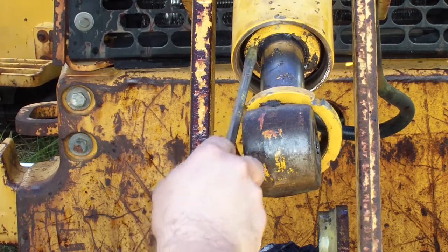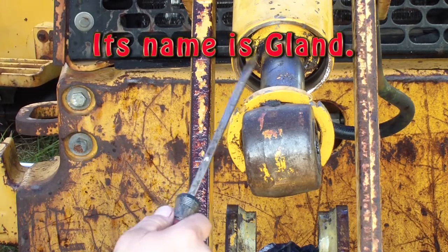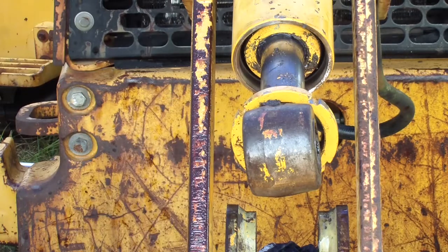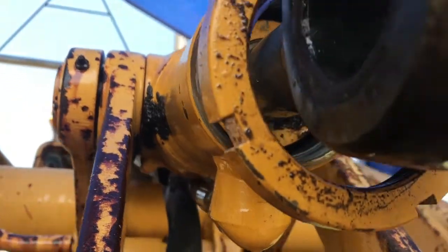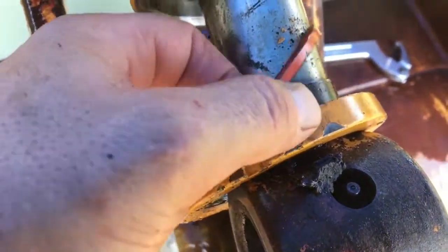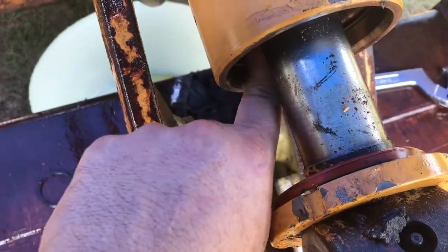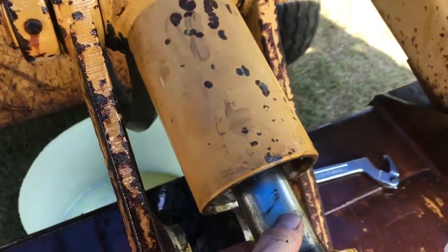Yes, there is a ring inside, a collar ring, keeping this nut in place, or the bladder, I believe they call this the bladder. And this nut will tie the bladder against the ring to keep it from going in or out. This is a half ring that will go around the groove, so it will make a continuous bore, so when this gets pulled out, the rings inside that are attached to this won't get damaged.